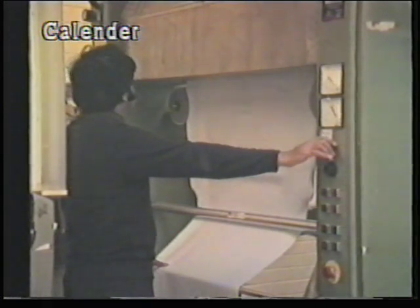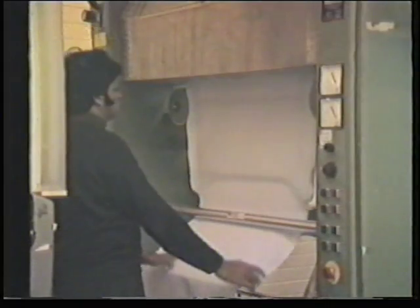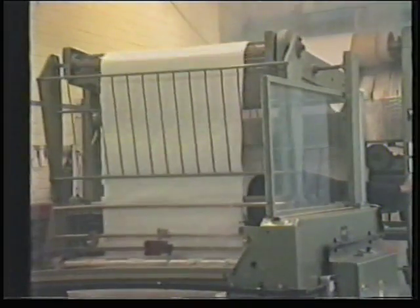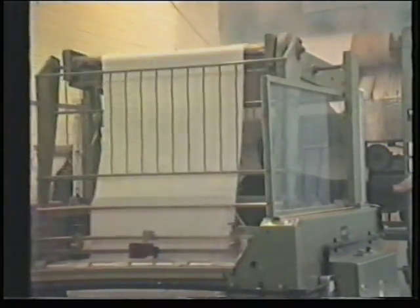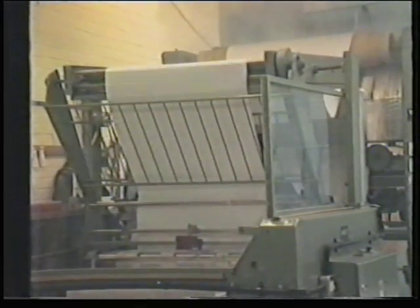The final process in finishing fabric still in tubular form is calendaring. This produces fabric to the correct width by passing it over a stretcher board and giving a light steam to produce a flat finish. Final inspection is often combined with the calendaring process.